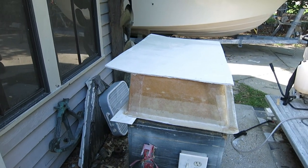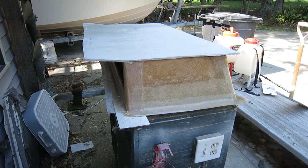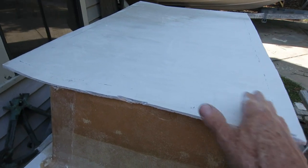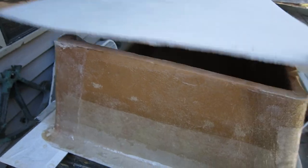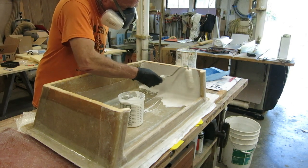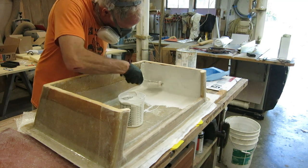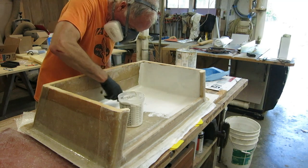I have access to another boat that's being cut up, and also the dump, so I went today and cut some of the interior closure panels. One of them is big enough for the bottom of the T-top console box. I've got it sitting up here — it sits pretty flat and smooth on the bottom. I'm going to trim it, glue it in place, and after the glue dries I'll bevel the edges and put some glass to tie it all together. But before I glue this on, I want to paint the interior of the box because it'll be hard to get to after the fact. I'm ready to mix up some epoxy paint and make it white on the inside. Unlike most house paints and enamels, epoxy paint does not cure through evaporation, so you don't have to worry about putting it on too thick — the surface won't skin over and leave the underneath uncured. I tend to put it on nice and heavy in these situations to cover up all my little imperfections as much as I can.